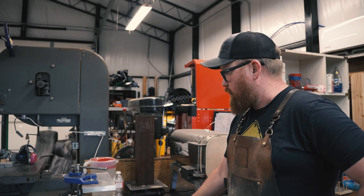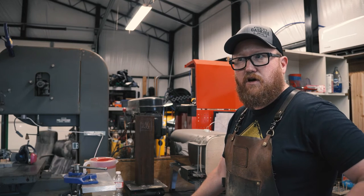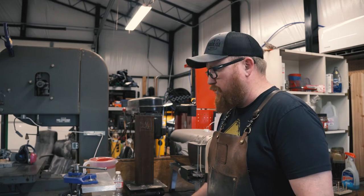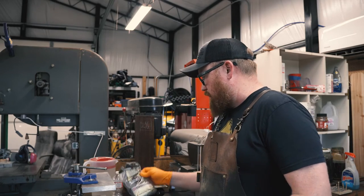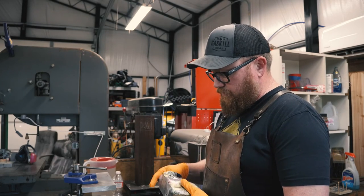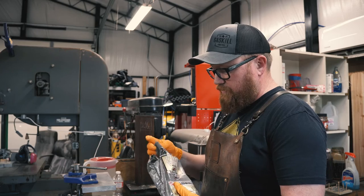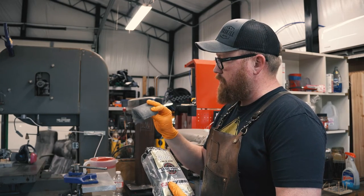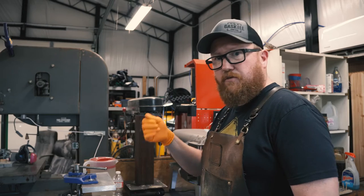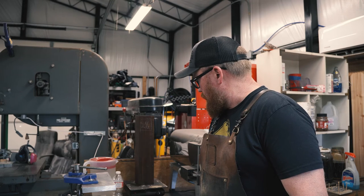When you originally mix the solution, what you'll do is bring your 114 ounces of water up to temperature, I believe 140 degrees, anywhere between 120 and 160. They tell you to target 140. And then you put in your 14 ounces of solution, and then you need to activate it or prime it, I don't know exactly the technical term, but you can use powdered steel in a coffee filter, or I just put in a couple of these 4-aught steel wool biscuits, and it worked pretty well. Leave them in for about an hour, and then I fished them back out with some tongs out of the solution. Let's talk about the other equipment you'll need.